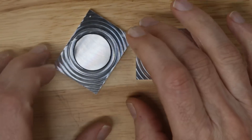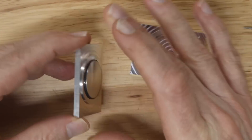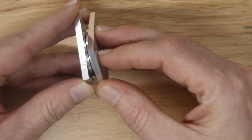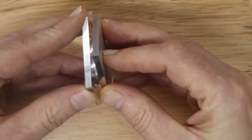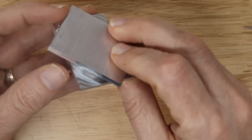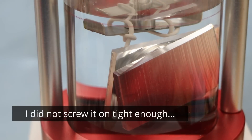The 26mm O-ring holds on a little bit better. One thing I'm noticing is that in a few places it's getting stuck in the thread and doesn't want to go down — that makes sense because of the geometry. So I put a little bit of pressure and rotate backwards until it drops into the thread, then turn it forward. It threads in place and I can feel resistance from the O-ring. I don't see a gap, so it's looking good. I'll run this through the depth test.